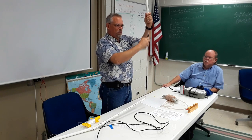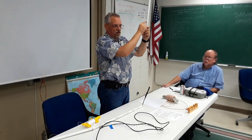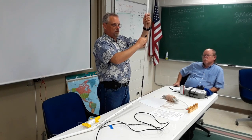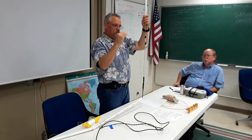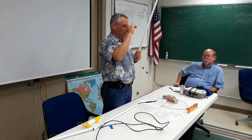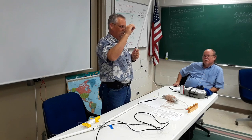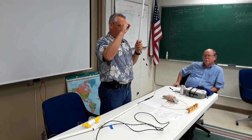This is about a quarter wavelength, and then I get it all on my test jig in the pipe that I'm going to test it with, or free space, depending on how I'm going to use the antenna. And then I just slowly start trimming back until I get it down into the band that I want. By slowly trimming, I'm talking about tiny pieces. A quarter inch? Way too much. I'm talking about 1/16 of an inch, just a nibble. Just take your time. Nibble, nibble, nibble.